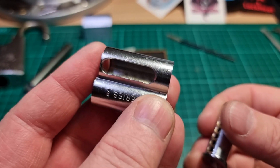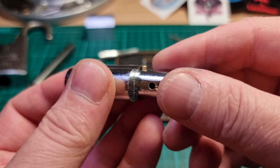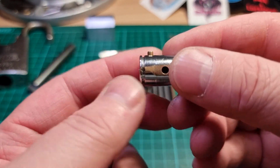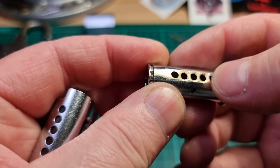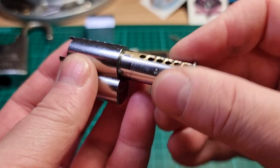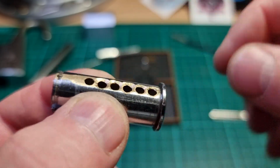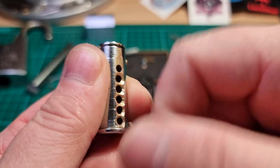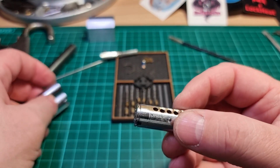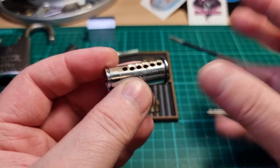So this is the lock body there, and it's got this little pin that pops out. So if that pin, if you rotate it this way and the pin pops up into those driver holes there, those driver chambers, it's good night. But I think somebody's had a gutting disaster, like a standard one, and maybe had to force the lock back round, damaging one side or the other of these chambers, and then he's taken a drill bit and tried to clean up the damage, but he's filed away quite a bit. So that's why it felt strange to pick. The counter rotation wasn't smooth, and it just felt really weird.